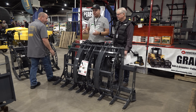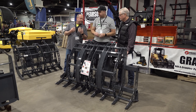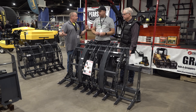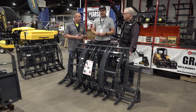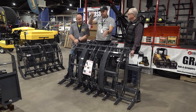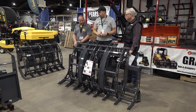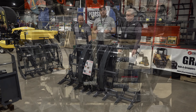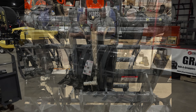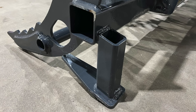Your struggle is real because you're right on that horsepower cutoff - right at 40 or slightly over. This smaller one might do the trick. I'm not a believer that the grapple has to be as wide as the tractor - a 60 inch is going to be wide enough to grab something and keep it from flopping around. I also love that you're using higher quality cylinders instead of tie rod cylinders - they're still resealable and serviceable. We've got double stands built into this one as well.